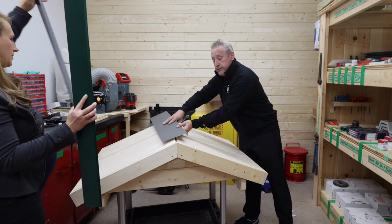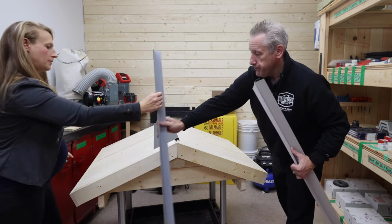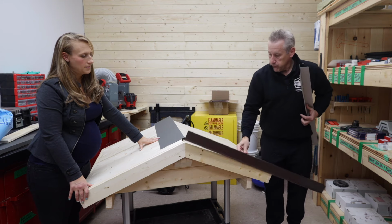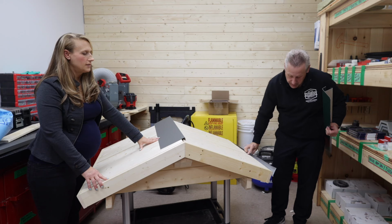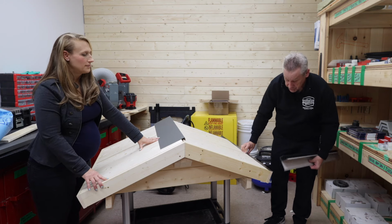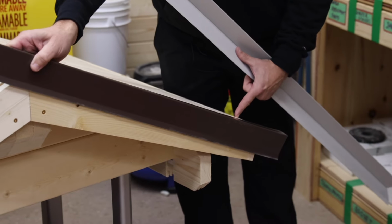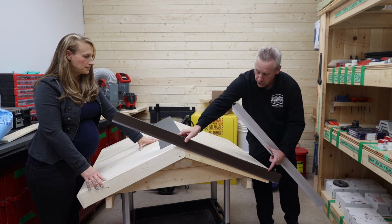So this gable end can be done one of two ways. There's a traditional gable starter, which is basically an L-shaped bracket or L-shaped trim. It would just sit over top of the edge. The eave starter is almost the exact same piece. In fact, it is. The difference basically is that it's 90 degrees. So the eave starter would go on, which is what this is meant to be on the eave, and then this piece would come over top on the edge. So the gable's after the eave. That makes sense? Because the water would then roll off versus underneath it.